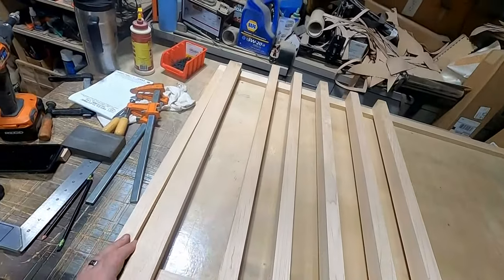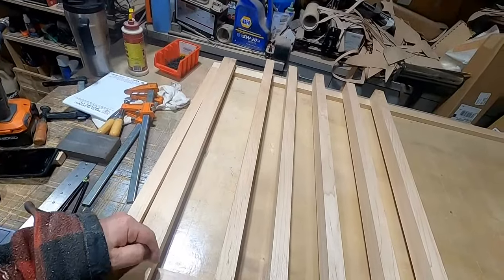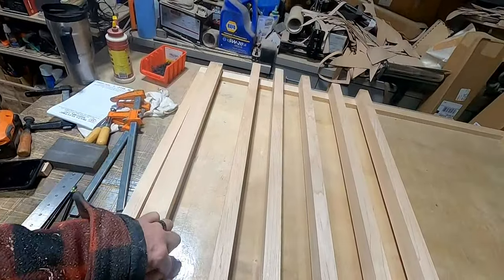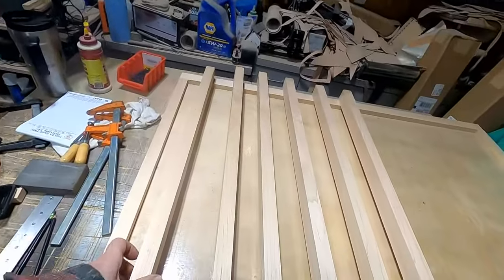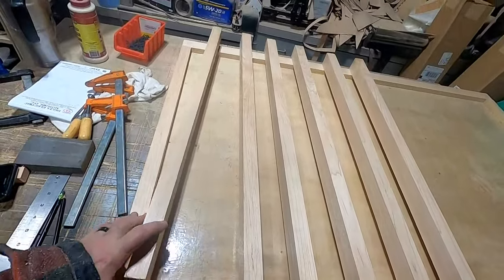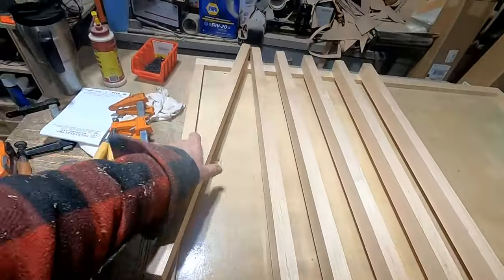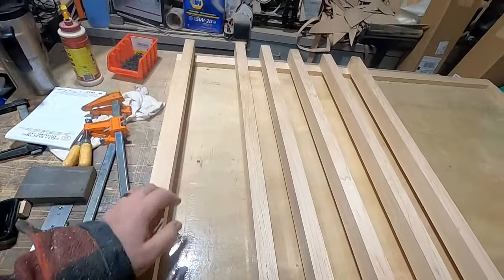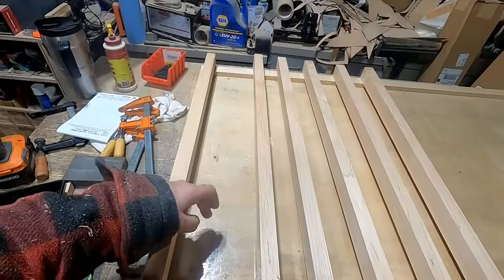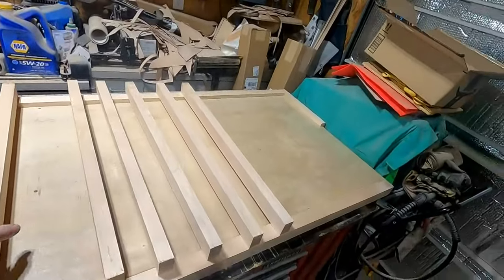And then from here, after I get this hole drilled, I'm going to notch across the bottom of these, so these will actually sit down underneath these, because not everything is 7/16 thick. So this is 7/16 on this lip, and that lip over there is 7/16. So if I want something that's going to be like 1/2 inch, I'm going to be able to actually put pressure down on the whole thing.